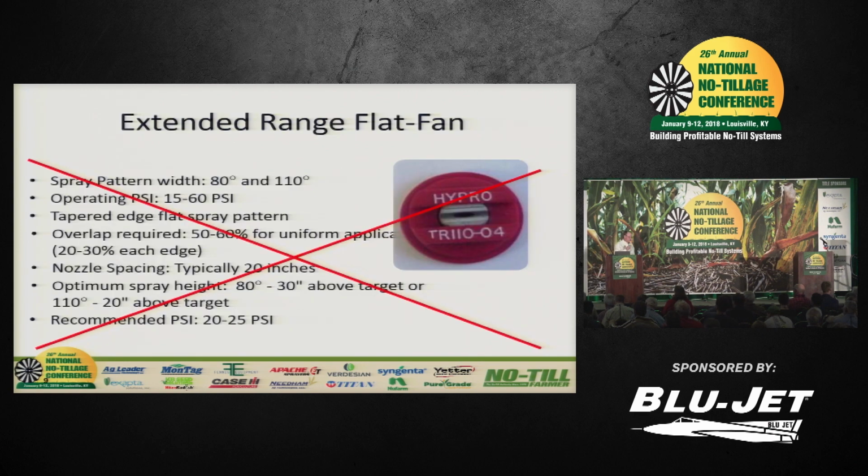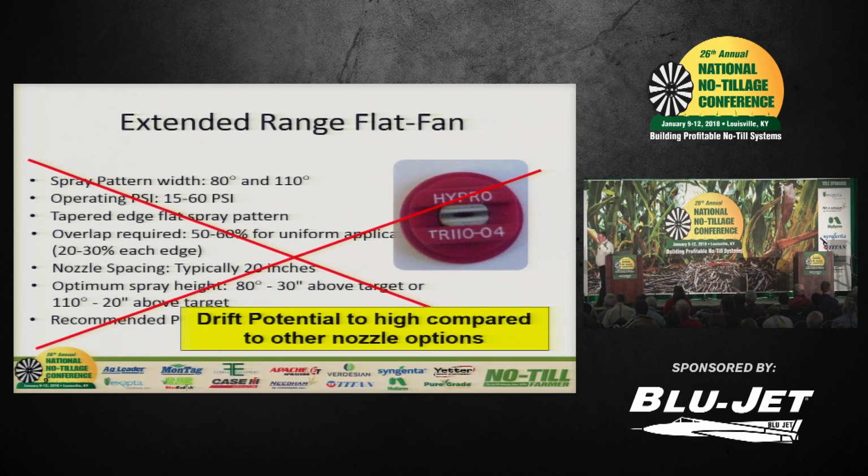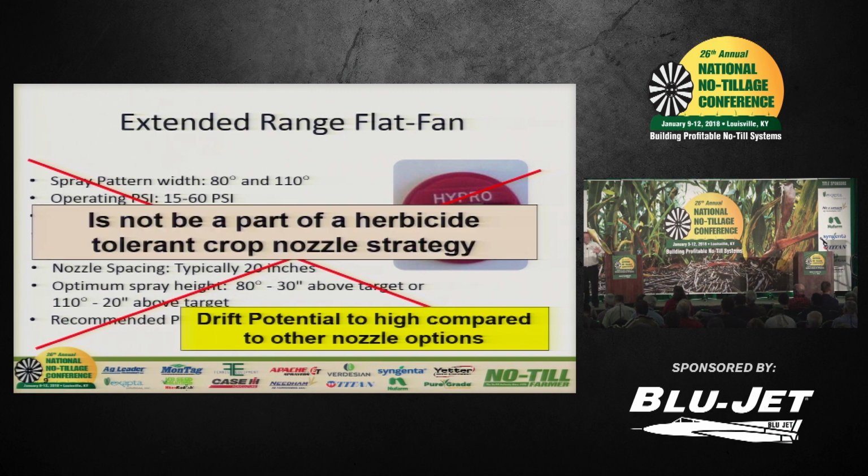So here's where I stand after the last 10 years in this business. I do not recommend this nozzle anymore. Now normally I'd ask my audience who's still using them, and I cover my eyes so I can't see your answer. But I can't see you anyway, so I'm not going to ask. But if you are, I would suggest that they be pulled and replaced, because we have better technology today that can do what that nozzle was designed to do 30 plus years ago, give good coverage. So this nozzle has a very, very high potential for spray drift, and I'll show you some data to support that. And it will not ever be a part of a dicamba tolerant package.